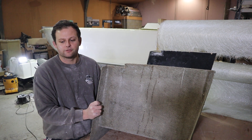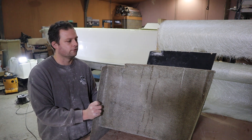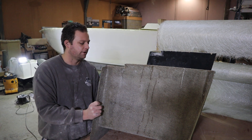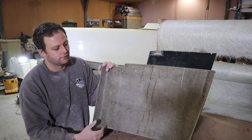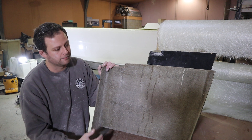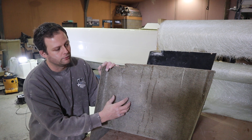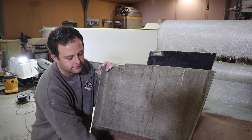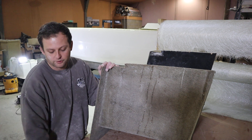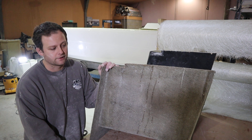So first of all, we've assessed what's flat, what's not, what needed doing and just went over it to see where we're going to end up. After that, I've ground off these faces, got rid of all the dead fibreglass, all the mould, mildew and whatever else was built up, and tried to go back to something a bit more clean — something nice to bond to. Like repairing a wound, you've got to remove the dead flesh before you can start to rebuild and recover.